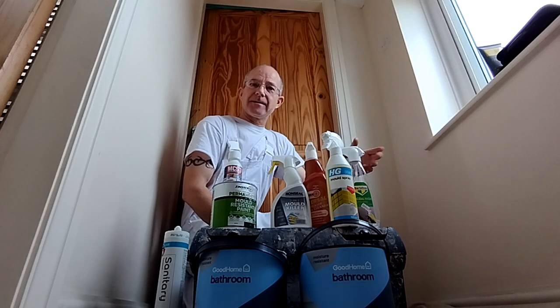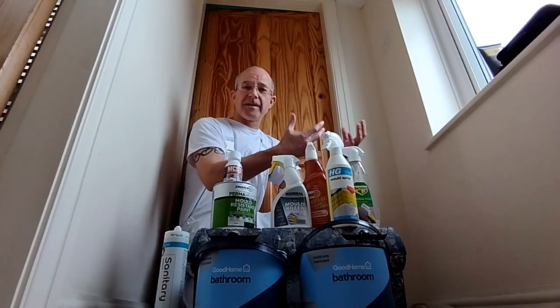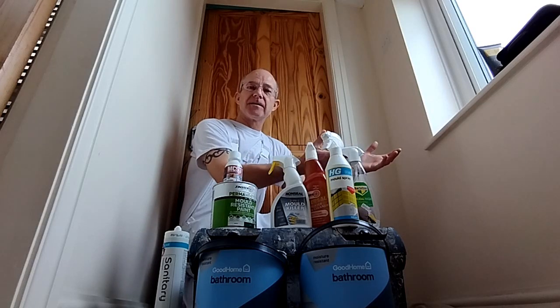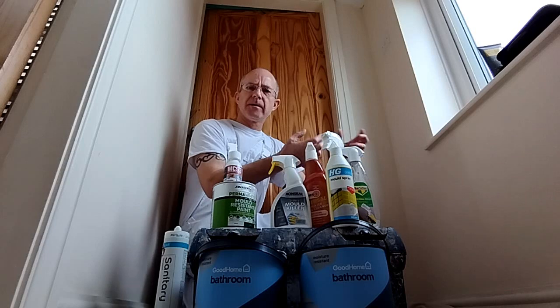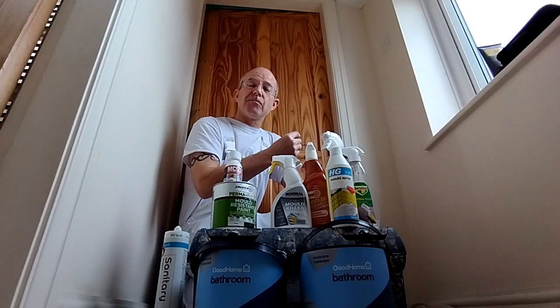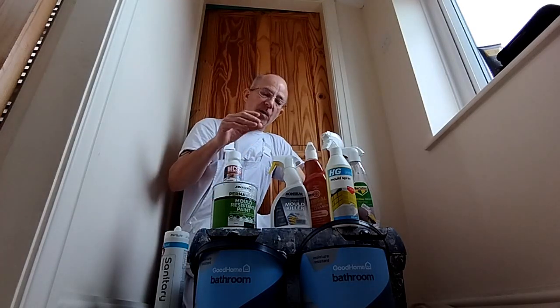With coal fires, all the wet air would just go up the chimney, so generally the house was quite dry. But these days coal fires are gone — you've got gas fires, central heating, tumble dryers working, cooking in the kitchen, showers, steam everywhere. So it's an inevitable thing that you're going to get condensation lying on things. And as soon as you start getting condensation at the right temperature, mold will just start growing, because the actual spores of mold are generally in the air — they just need the right conditions to start growth.